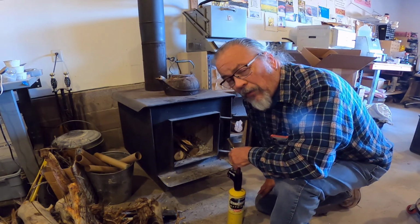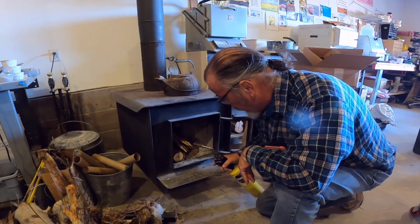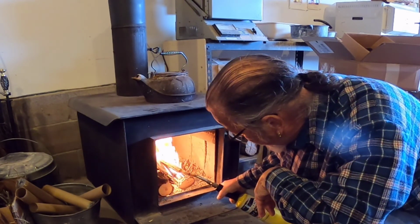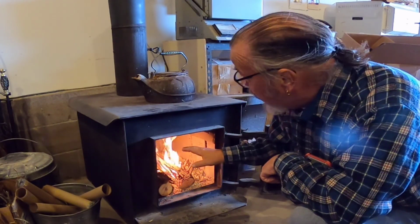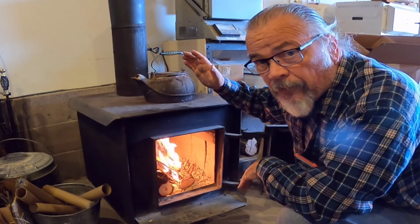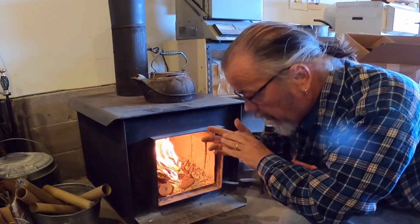Now, Irene and I start these fires in two different ways. I know that. She's going to be a little surprised today. But I use the Instant On torch that's down here in the studio. Now that fire started. I use the torch because I want to heat up the volume of air that goes up in the stack, because there's a 90-degree elbow about 3.5 feet above the stove. That affects the draw. By using that torch, I heat enough of the air up that it will start drawing. It's drawing just fine now.